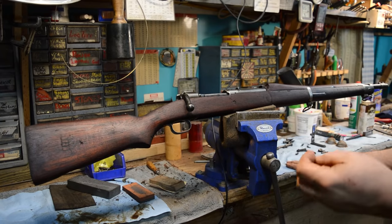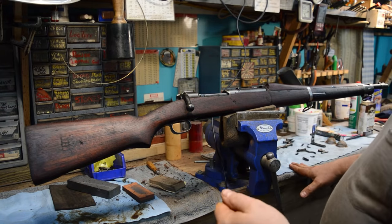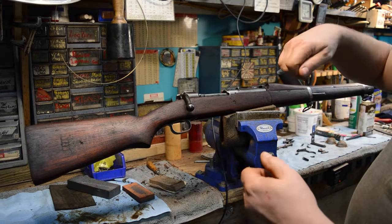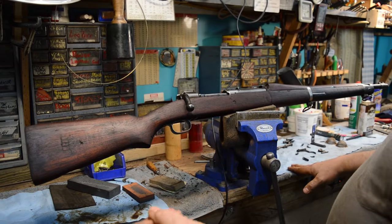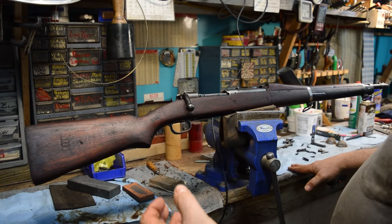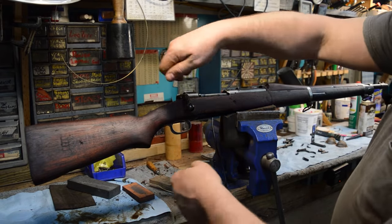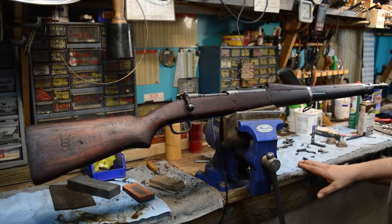But, you know, just to summarize, what we covered was how to begin by scraping, filing, raising dents by steaming, carding, using scrapers, and then finally cutting through to sandpapers and finishes where we oiled it down, stains that I like to use, and then we were into waxes, which is just going to be hot air gun, toilet bowl ring, all the way down this thing, and it'll be done, and it'll look right.